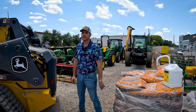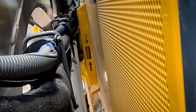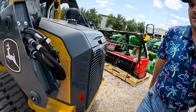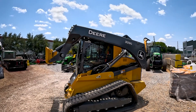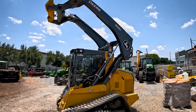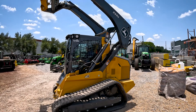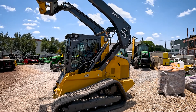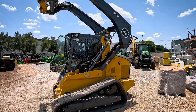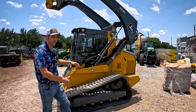Now let's see where they put the hydraulic sight glass on the Deere — it's right there, so you can clearly see your hydraulic level. Now let me show you something else on the Deere. What I'm doing right now is I just extended the boom lock and I'm going to lower the boom just a little bit — and there you go, it just caught on the lock. So the boom is safely locked out, resting on the lock so I can safely walk underneath it to service it.